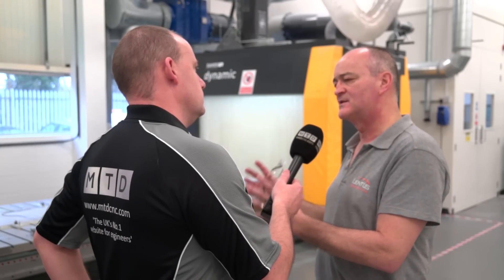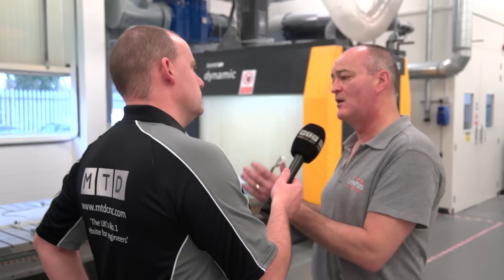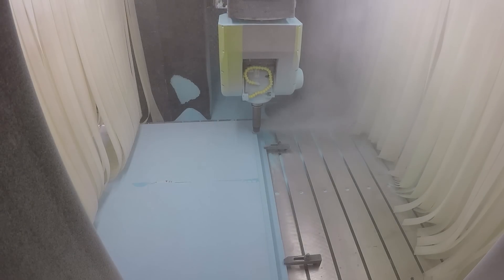And what are the types of parts that you're making here out of this model board, Rupert? So I've got a medical customer who sends me resin impregnated coils. We machine diameters on those — it's really important that the ID of the component is concentric with the OD that we're asked to machine, so it fits into a superconducting magnet system. A lot of motorsport work — anything from an aerofoil-type surface to a wing mirror bracket to various brackets. Absolutely anything — if you can think of it, we can design it and make the pattern for it on this machine.